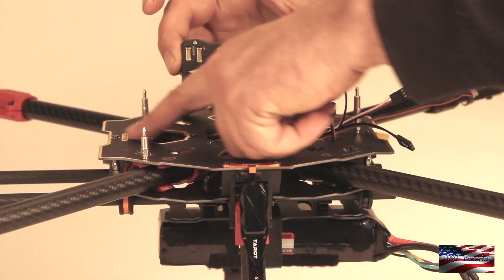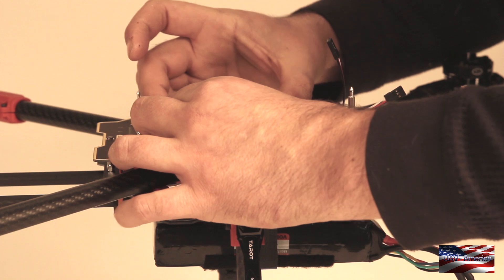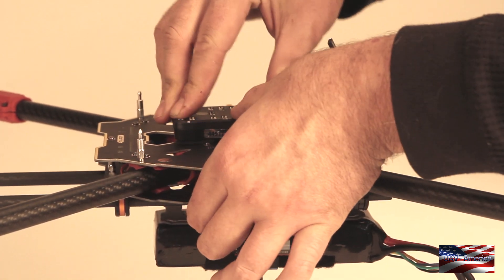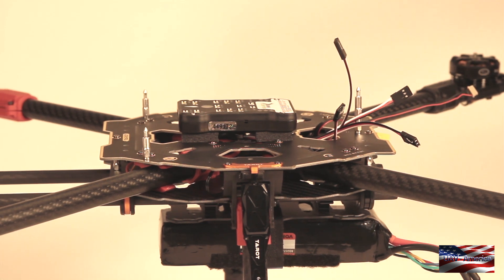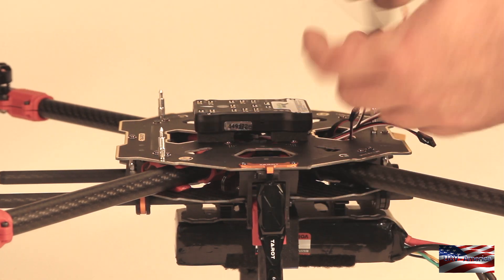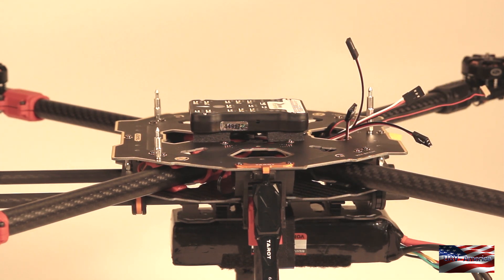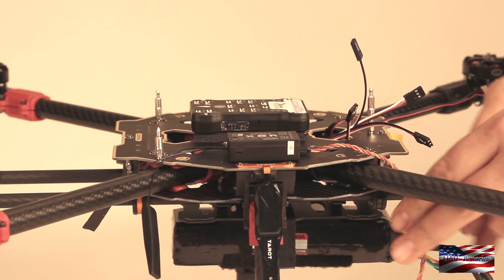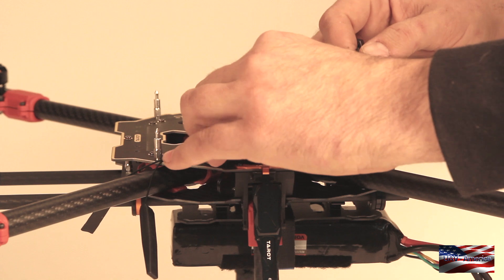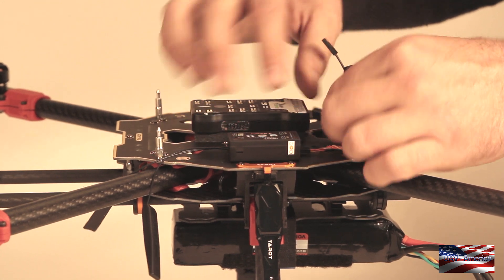You can see I've got the red motor nacelles on the front — this is our front. You want to get it nice and square and straight; you don't want it crooked on the frame at all. Set it down and compress that foam down. Next we're going to mount the X8R receiver. I'm using a longer S-bus cable than what's included with the Pixhawk because of the location I'm putting the receiver on the left side, leaving a little distance to the flight controller. This cable goes from the S-bus port on the X8R receiver to the RC in on the Pixhawk.